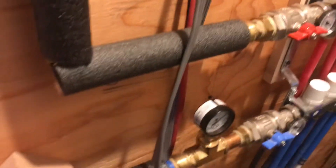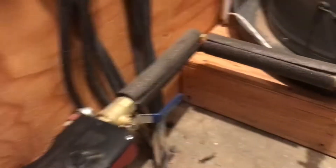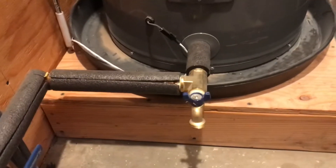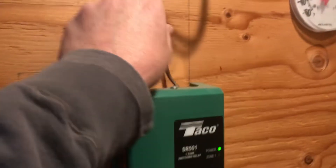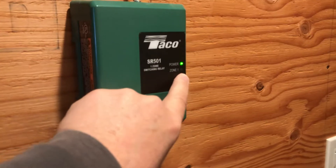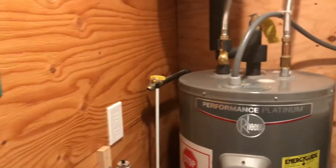The water comes back into the manifold and gets pushed back down into the tank using a small electric pump, which pushes water into the bottom of the tank. We took off the spigot, put a T on for the water return, and replaced the spigot so we can still drain or service the water heater. There's also a thermostat line going to a thermostat and a relay — when the room drops to the set temperature, the relay kicks on the water pump, water circulates until the room reaches the desired temperature, then it shuts back off.